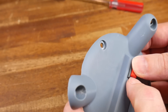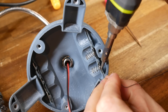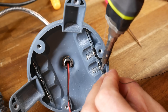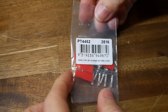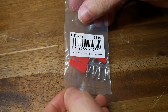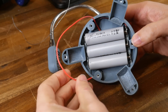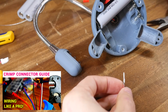Time to finish off the rest of the wiring in the main housing. I recycled the clipped-off leads from the LEDs to solder between each of the battery terminals, putting the three cells in parallel. I thought it best to include some plugs to attach the switch and the charger on the lower housing to the wires feeding into the upper housing. On either side of the cells was an empty cavity where the plugs could sit. I then crimped on the connectors — I've got a video linked if you want to learn how to do that.